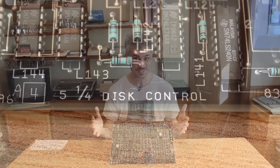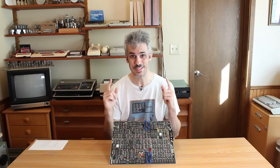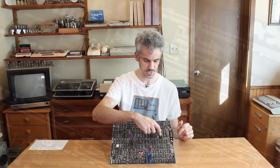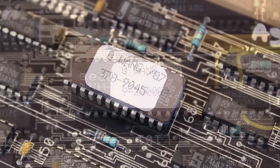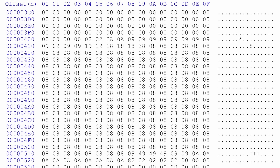Right up at the top it says 'five and a quarter disk control,' so there's a good possibility this is a disk controller card. That makes sense because we've got what very obviously looks like disk connectors right here. I also know that it's from 1986 because I pulled both ROMs off — a 2732 and a 2764 — and ripped the code off them for backup. The code from the 2732 looks very strange, possibly microcode, but the code from the 2764 had a copyright of 1986.